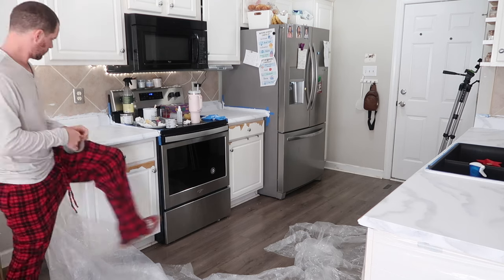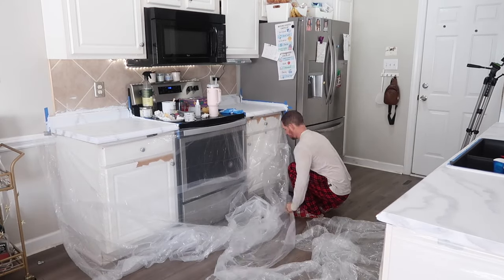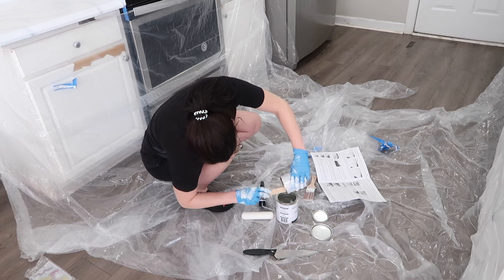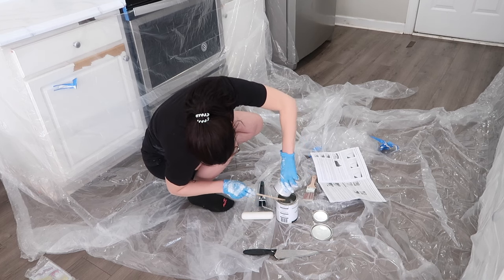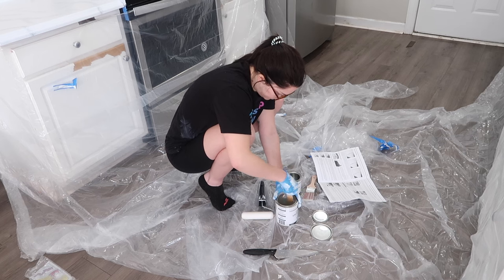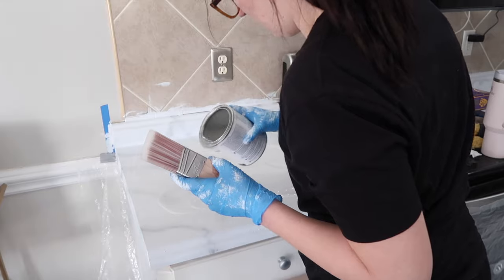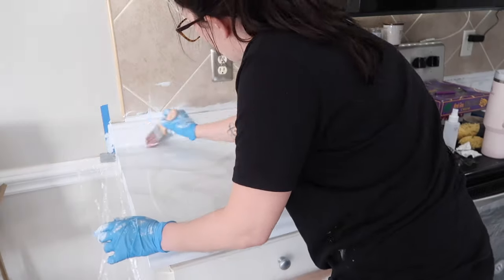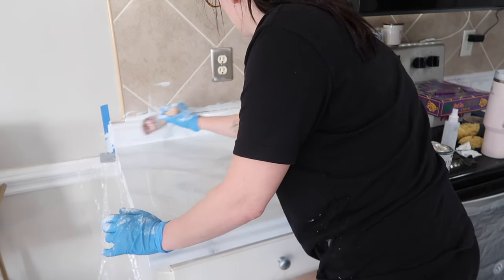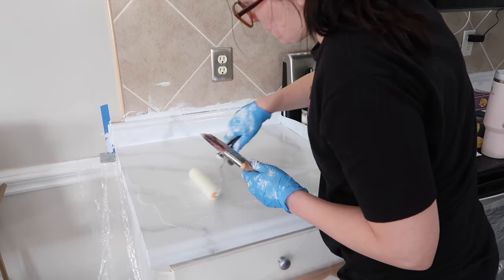The next step after the veining dried was the epoxy resin. This came in the kit and it was a little intimidating, but this is what makes it actually durable. This kit is designed for countertops, and when it dries it's an inert plastic meaning it doesn't transfer onto food. However, it is not meant to be cut on and very hot things should not be placed directly on it — though many widely available countertop types have these same restrictions. As someone with one of the highest food safety certifications available, I don't recommend putting food directly on countertops or cutting on them anyway — you need a cutting board. I did a lot of research and I'm a food safety weirdo, so this wasn't a rash decision.